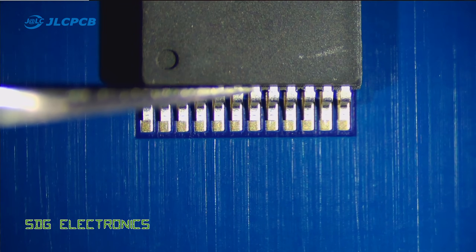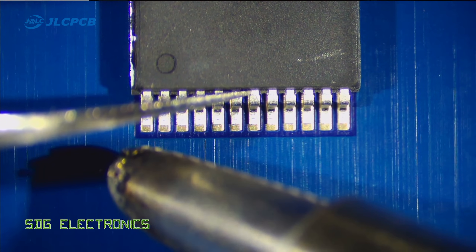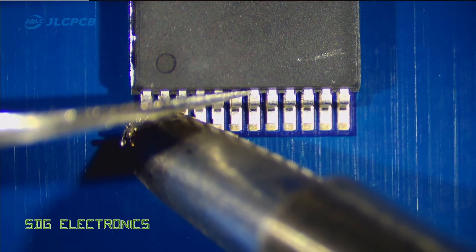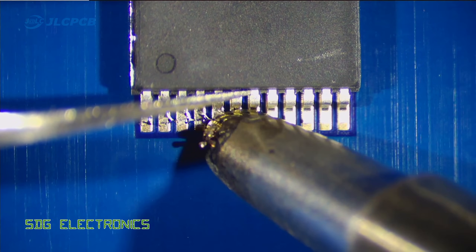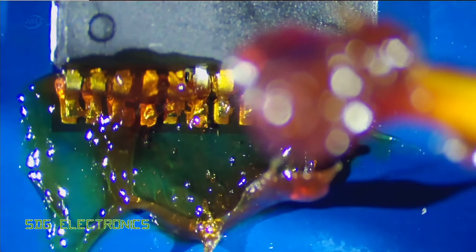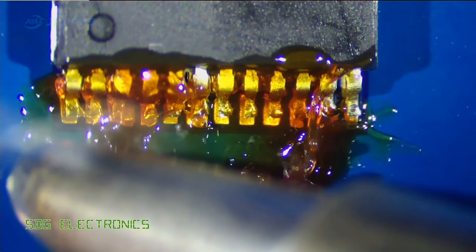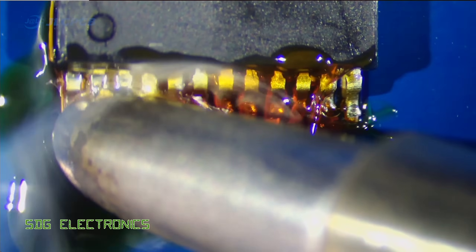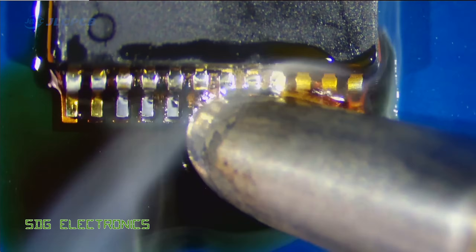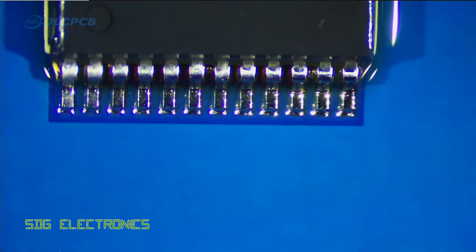To start off, I wanted to show what happens if you try to drag solder without any additional flux. I've applied some solder to the tip of the soldering iron, and when you drag the soldering iron across the pins you get no wetting of solder onto the pins or onto the pads. But then if you apply some flux over the PCB and run the soldering iron along the pads again, the flux causes the solder to wick onto the pads and onto the legs, creating a really good solder joint. Once you've cleaned up the PCB you can see we're left with a very nice solder connection.